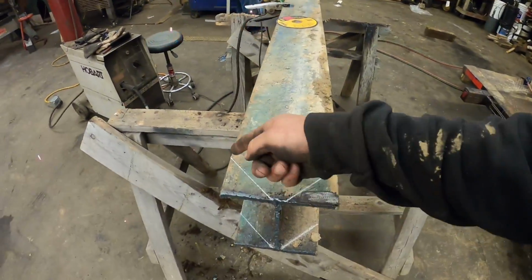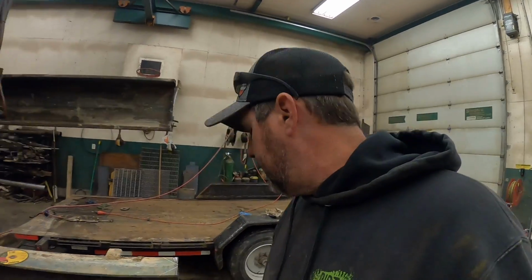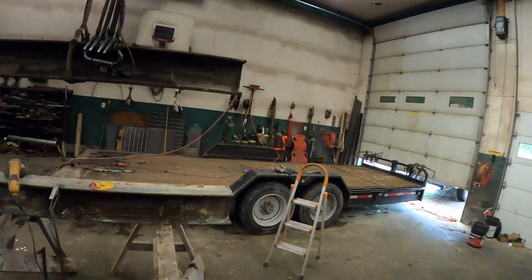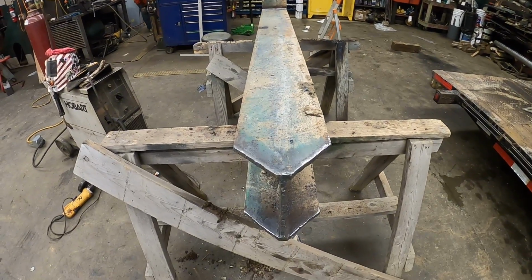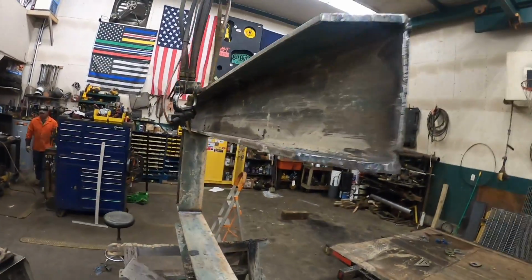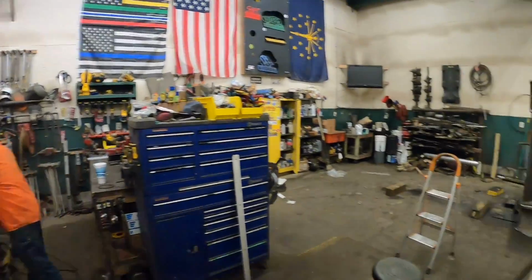Now here's welding that out. I'm gonna take the torch, 45 these corners, top and bottom. That way, one, it eliminates the sharp edges, and two, it should help us slide that pipe a little bit easier and not get caught up, and three, it won't create a point load inside that pipe right there. So let me carve those off there, and then we'll do the same thing on the back side. Voila! Nice polished edges. Should keep from getting caught or stabbed. Yep. Any of the above.